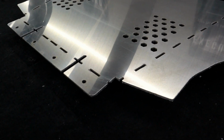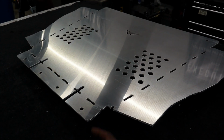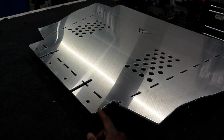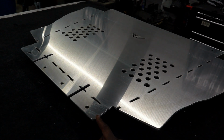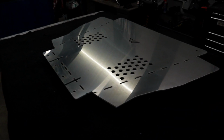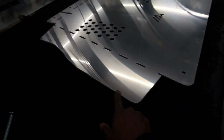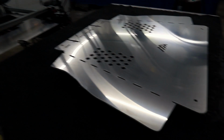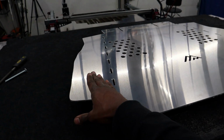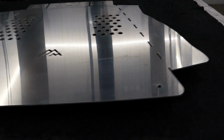So also, for those who do not have the cross members cut out in your Toyota Tundras, this one will actually slide between the original cross member and the aftermarket cross member. So you have options with this particular skid plate that we made. And as you see, we got some funny looking contours here. Well, that's because when this is angled up slightly, not a full 90, it's going to tuck inside of your frame rail. As you see right here, I made square peg holes.